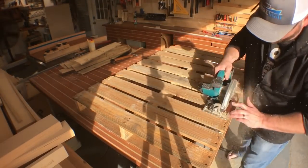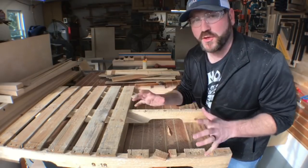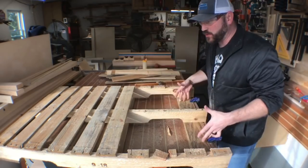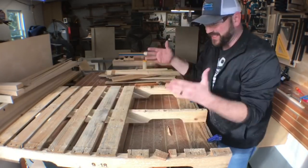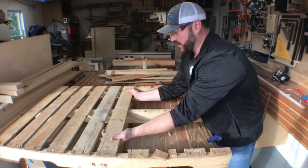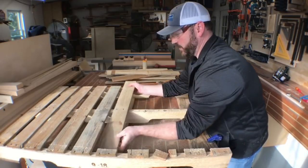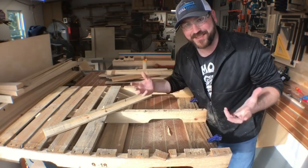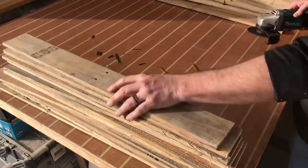As you can see I'm starting to rip down these pallets. Let me show you the best way I found to break these down. You simply attach the pallet to a work surface, take a circular saw and rip down each side. Once you get to this stage, the pieces are loose — pry bar optional. You take a piece, twist it underneath the ones in front of it, and it pops right out. That's the easiest way I found to take apart these monsters.